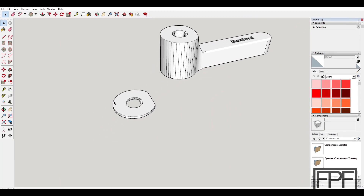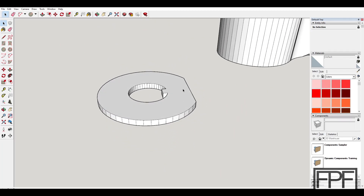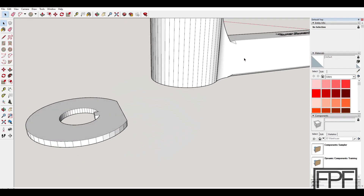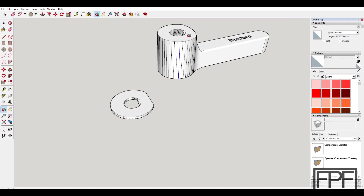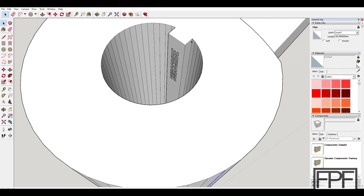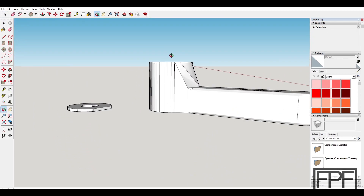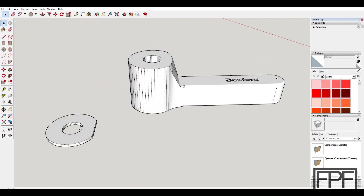You can see when I started on this, the first thing I did was basically just draw the profile of what this wrench was going to be like. My initial thought — the reason for this flat section — is I thought I'd just have a big flat handle coming off and then extrude this up a ways. I ended up changing it a bit just so it would print faster, as I didn't need the handle itself to be the full height of the tool. But I did want the tool itself to be quite tall — this is 55 millimeters in height — just so I had a nice long portion of engagement to grip on that lead screw, and in hopes that the key piece in here was not actually going to break off inside that keyway. Pretty straightforward and simple. I broke the edges so it was comfortable in the hand and rounded off the side.